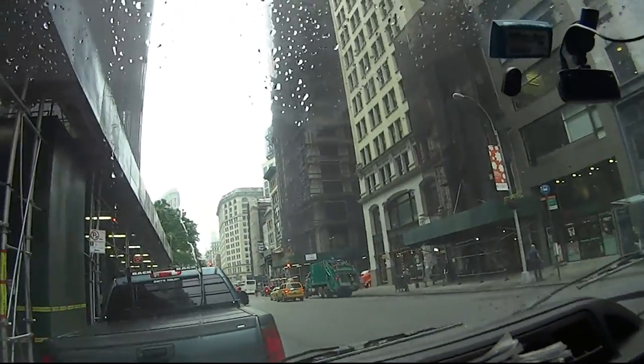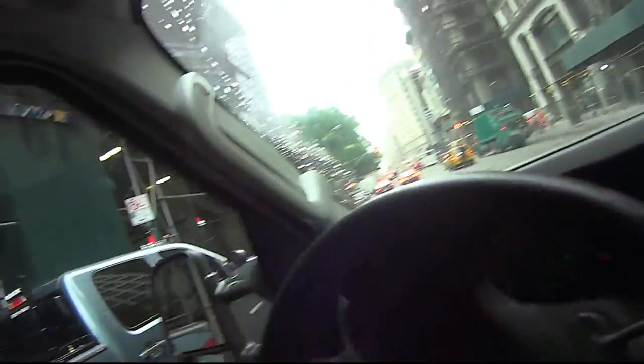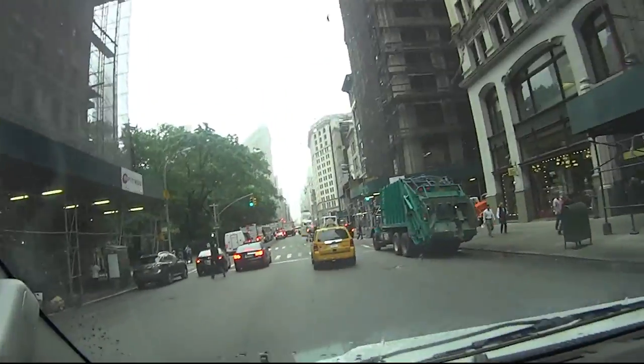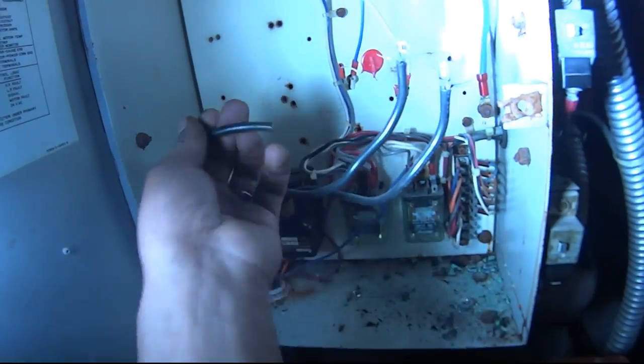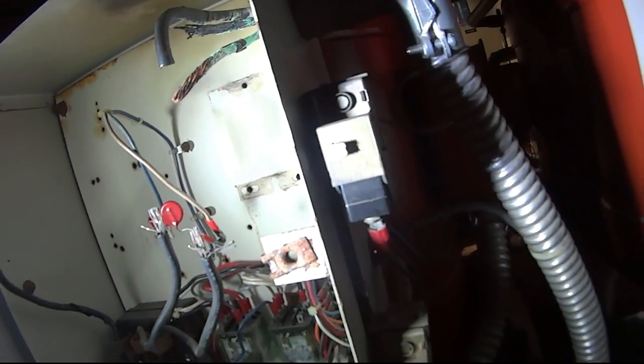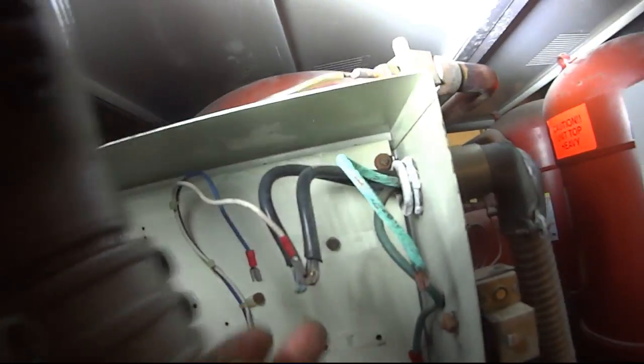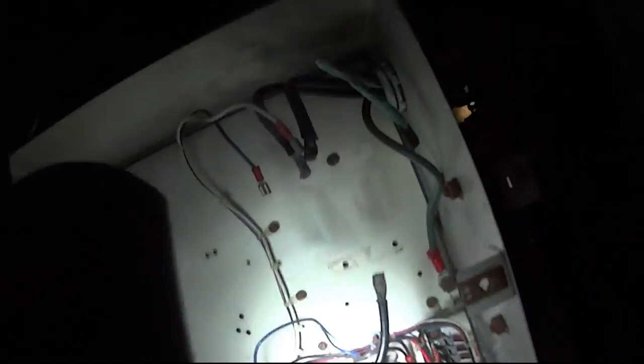I'm on my way to United. Alright guys, I got some number 6 wire, got some contactors. For this right here I'm just going to cut these back — instead of running new wire I'll cut it back and just connect them there. These three I'll pull out and fish new ones in. This one as well — I don't know the state of the other one, I'm just going to run all new wires. These kind of look good but I just can't trust it, so I'll redo the same here and use those connectors instead of running new wire.